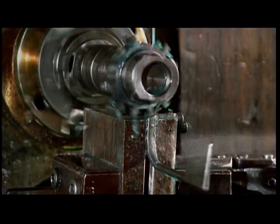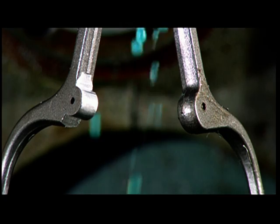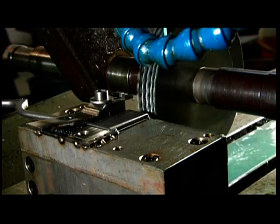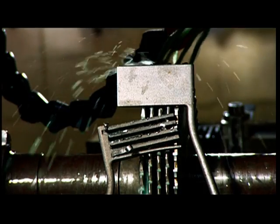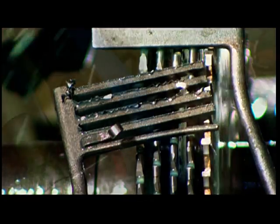surgery. Using a circular cutter, they round the profile of the tool's joint. This round joint allows the tool to open when the shanks are shut, the opposite of a pair of scissors. Next, cutters carve slots in two parts to create the retractor's intermeshing jaws. These jaws will be used to grasp and retract body tissue so the surgeon can operate.